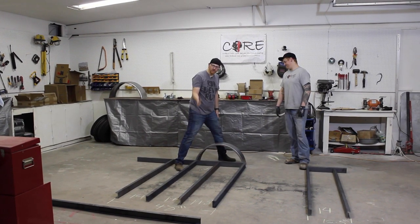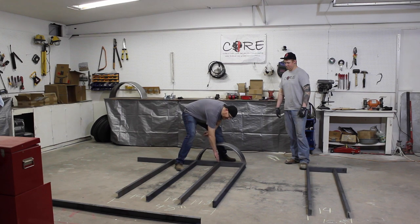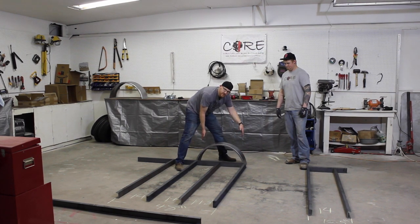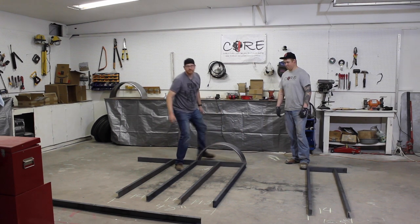So we ended up with our 48 inches and keeping our center where we're gonna have our axle underneath this runner ended up being just right where we have about an inch in front of this fender. Now this fender was 32 inches front to back, so we had a 16 inch center.